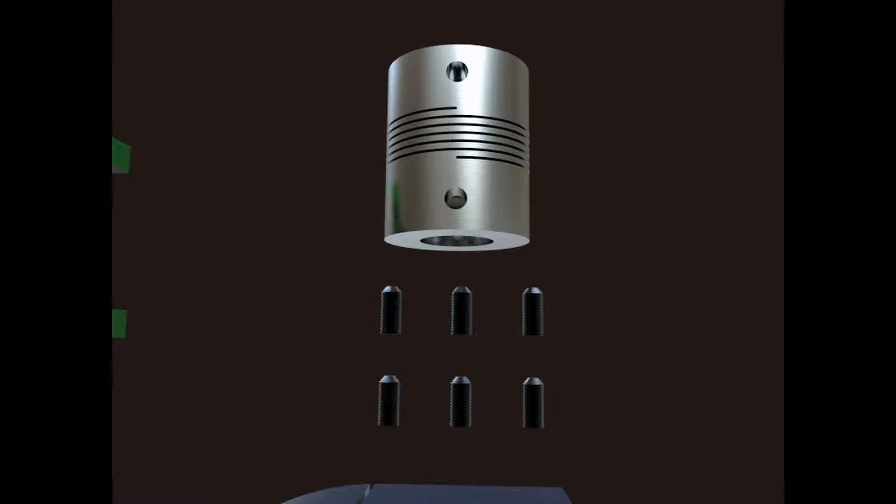By having three bolts on each side, that makes sure that our shafts are centered. I recommend getting the ones that have three bolts if you order your own. Next is our housing or motor mount that will actually mount our router in place. Of course, this is our cut head. We're going to be setting this up for a Porter Cable. There will be one mount at the top and one at the bottom to hold the motor in place correctly. It is a two-part system — the lateral saddle part attaches to our upright.